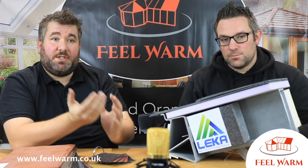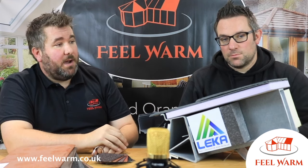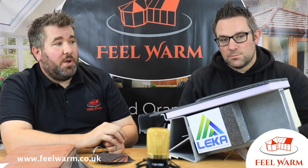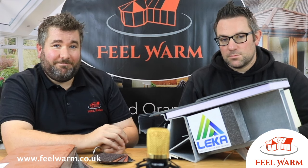Basically, what it sounds like on the tin, you've got an outer skin of the pipe and an inner skin of the pipe so that the heat doesn't radiate out to that outer skin, and that can go straight up through the roof section in between the rafters and then gets flashed on the top to make sure it's completely weatherproof. So absolutely no problem at all, although if you've got a log burner in the conservatory with one of our roofs on, you're going to get very warm.